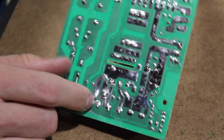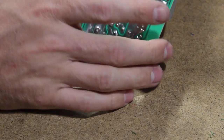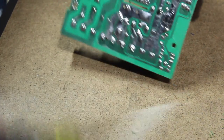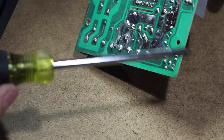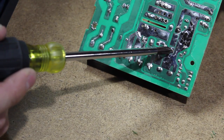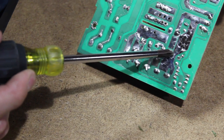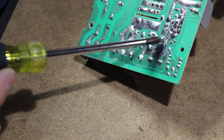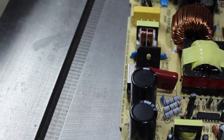Could do the big Clive and talk about separation slots. So that's arcing or spatter on the plastic shield there. Appears to be definitely coming from this right resistor there. Doesn't work when the capacitor is not connected. Cool. Let this be a life lesson. What I was trying to say is this capacitor is not connected. That solder joint, I wouldn't even call it cold or bad, it's just not there. So that could be a problem. Done.